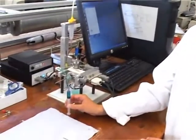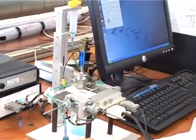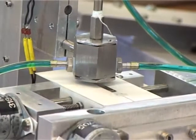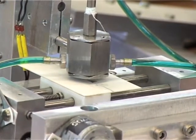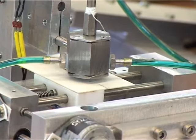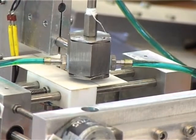The first step is to insert the solution into the ink chamber. When we have the right position, we adjust all the parameters such as the opening time of the nozzle, the number of increments, the inter-droplet distance, and the number of cycles.